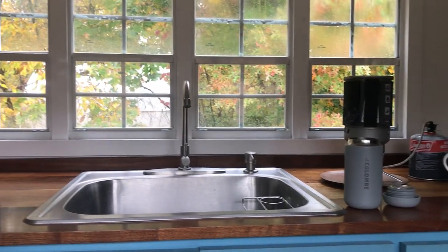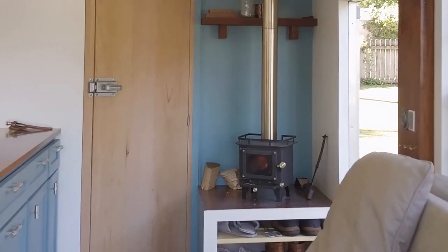This is only about 80 square feet and this thing is rated for 200 square feet — which, if you had a really well insulated space, sure. Our place isn't that insulated; we've got all these windows which I cover up at night. Heat output: incredibly happy. Another concern with any heating source in a small space is safety. As long as you're keeping fresh air in the space, you've got a carbon monoxide detector, a fire extinguisher, and you follow the rules on clearances, they're safe. On their website you can also buy a fresh air intake to pull fresh air from outside, but we just crack a window.